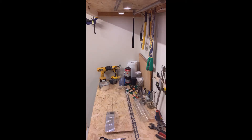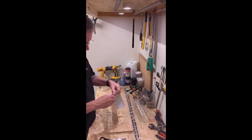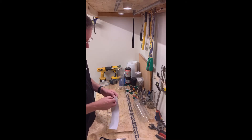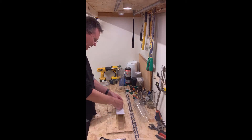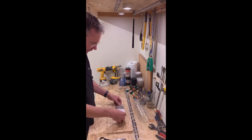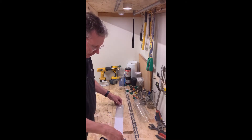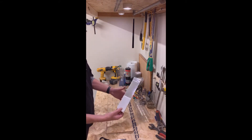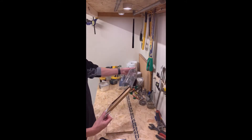Now the bit that's a little more interesting — you might wonder what the bit of wood is about. This tape is self-adhesive, so you have to peel it off, and this stuff is super super sticky and an absolute nightmare to deal with. What I do is just lay it flat on the wood and hold it down at one end. Then rather than pulling the backing tape all the way off — which makes it curl — I just pull it down towards the end and then pick it up and peel it off my fingers.